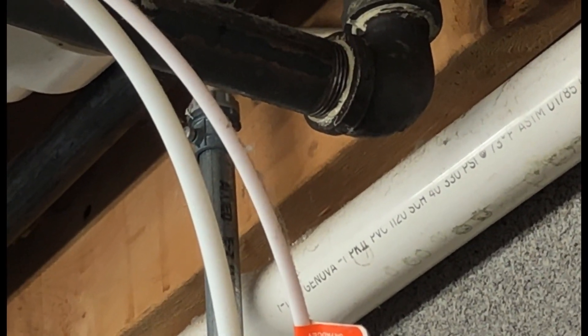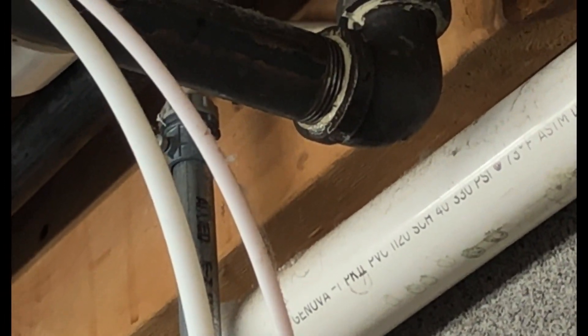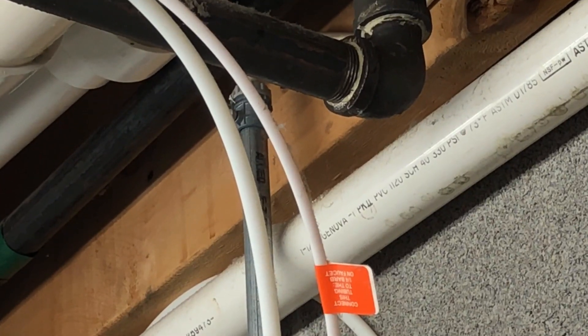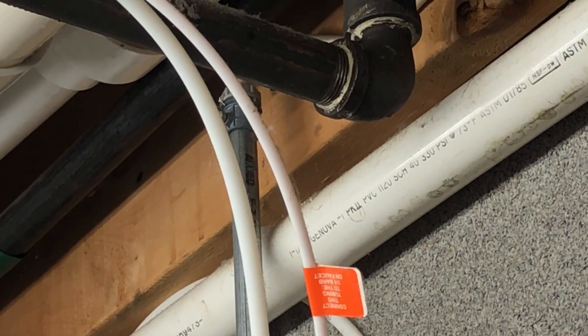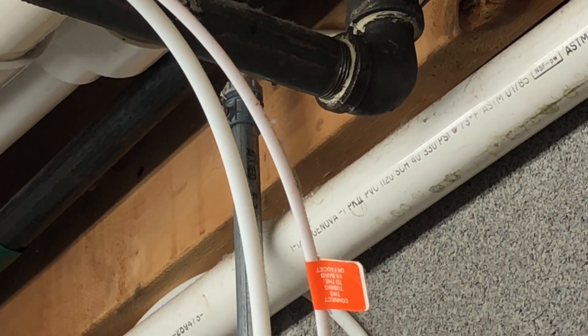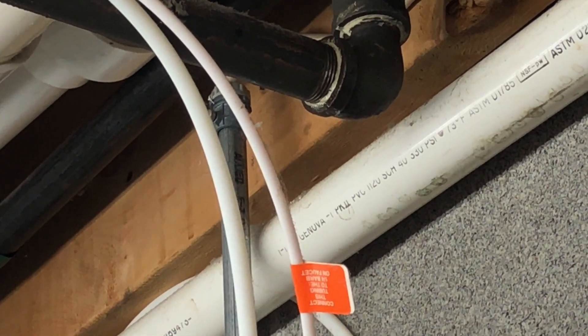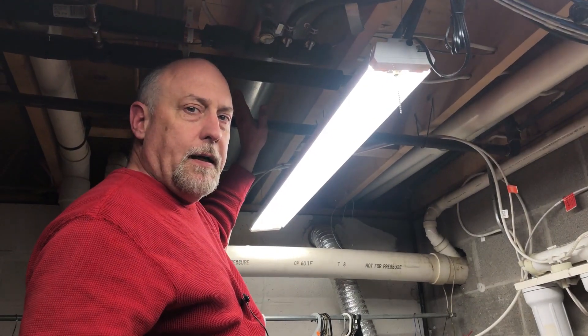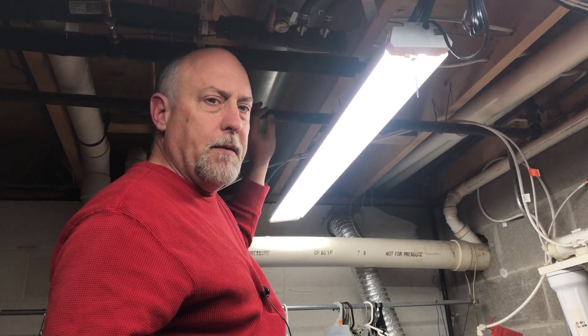If this was a house we're doing service work at, this is a billable repair — we want to get that fixed. We don't want gas leaking in the house. Some of the homeowners might smell that. This one's a little bit tricky because we'd have to cut the line here — probably cut it in half, take it apart, and put a union in between. But it gives you an idea of the value of having a gas leak detector.